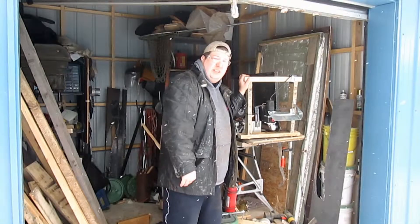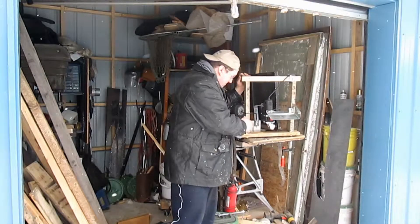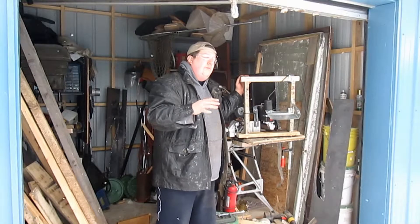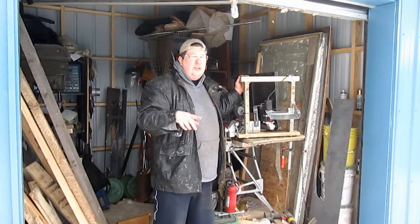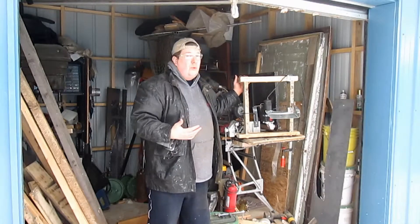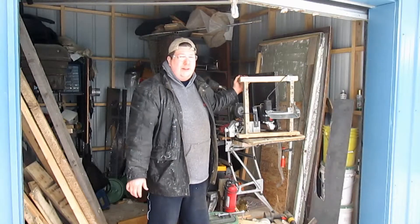This is just a piece of crap steel I picked up. If you take the guard off an angle grinder, 85 to 90% of all the hot slag will follow a nice predictable fashion — usually running from the right as you face down, because an angle grinder moves in a clockwise motion. This shield is for the last 15%; you don't want it flying around the shop or into your skin. Angle grinder slag isn't the worst, but if you get hit with enough of it, you'll be pretty raw for about a day.